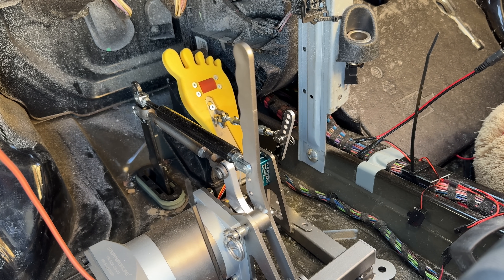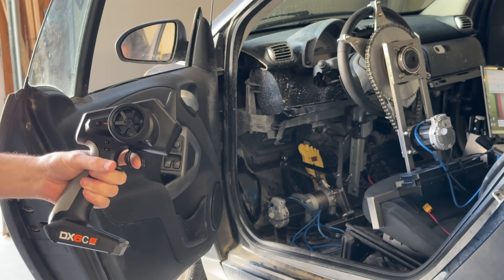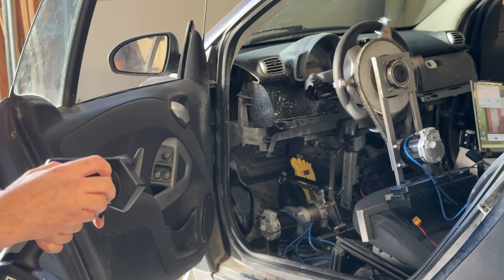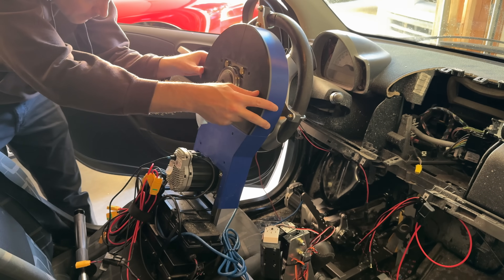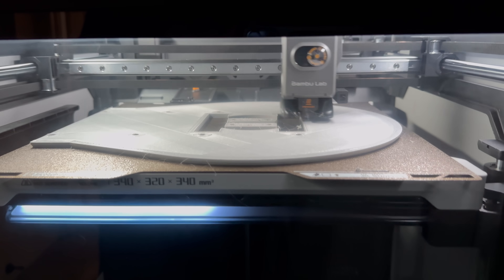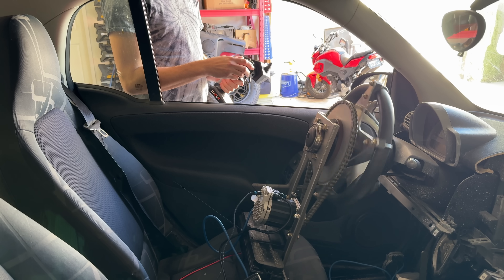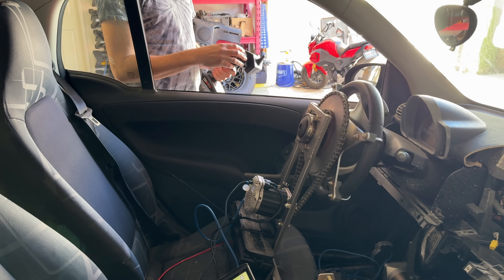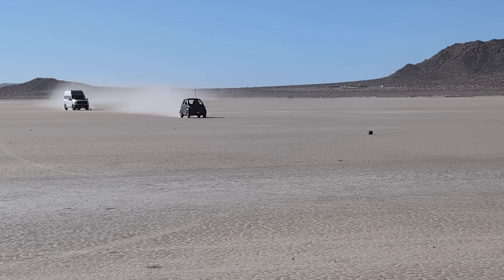When you turn on the controller and receiver, the servo motor powers against the gas strut, unpressing the brakes, until you push the throttle controller forward — and then it motors forward and presses the brakes with the help of the gas strut. The steering is pretty basic. This is a fixture that attaches to the steering wheel and has a sprocket on it. Below that is a servo motor with another sprocket and a chain connecting the two. The motor is the same one as the brakes, just no gear reduction. I 3D printed a cover for this so I wouldn't accidentally chop off my fingers. The fixture just reacts against the seat, just like someone driving the car. The only thing it's physically attached to is the steering wheel. The bearing at the top is a wheel hub from a Dodge Viper.